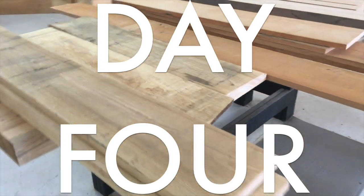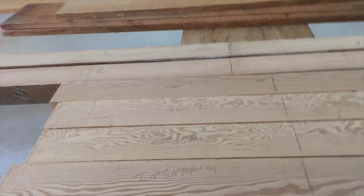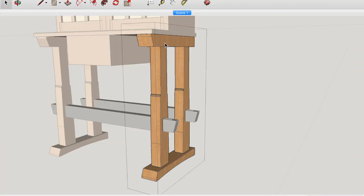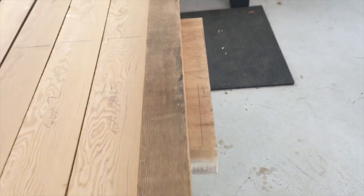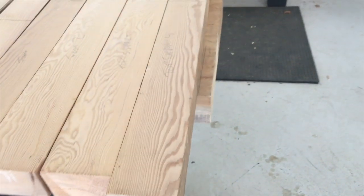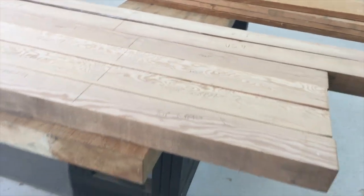So we get the lumber all laid out, got it in from the car, and I'm going to walk you through my thought process. Dealing with the big posts for the bottom section, I'm going to be cutting this one — these two pieces become the top supports, one and two. So I'll cut this in half and dimension it down. I have specific dimensions in my cut list, but it could be three inches or two and seven-eighths — I really don't care, it's not going to make any structural difference. Visually you won't notice much of a difference either, so I'm just going to mill it until it's six-sided square.